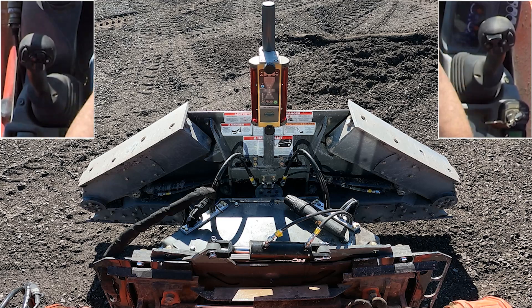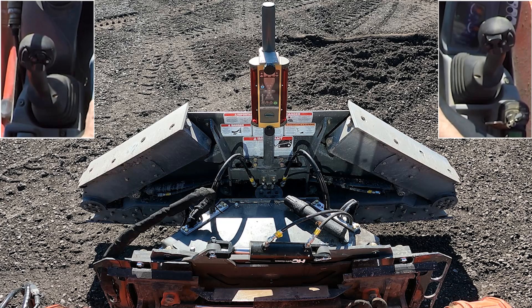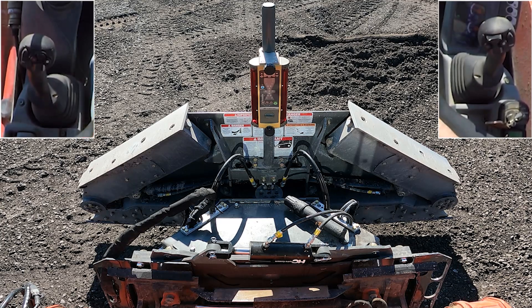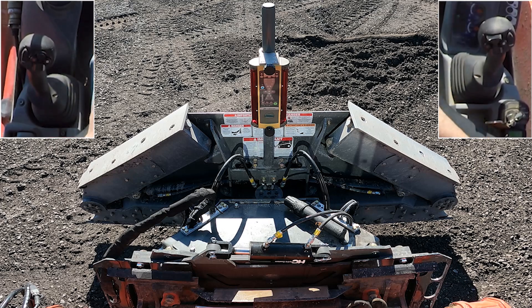Now what's important to understand is that in a non-automated blade model, like this one, we use a three-section on-off spool valve. The way it works is that we need to use an electrical auxiliary to send voltage to open a section of the valve when we need to redirect the oil to a specific cylinder for a specific function.